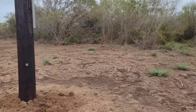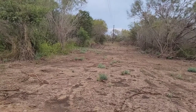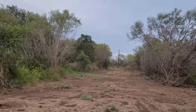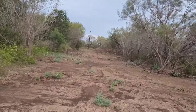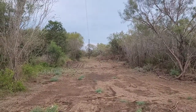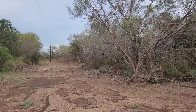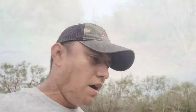They ended up clearing out about a 30-foot wide section on my property and they just go to the nearest pole you have on your property — that's where they run the electricity from. If you don't have a pole on your property, say you have a small five-acre piece and the pole is outside your property, you'd have to do an easement or agreement with your neighbor or the closest person who has a pole service. Fortunately I had two or three poles on my property so I didn't need to do that.